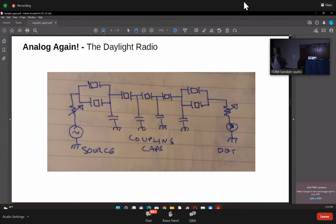The good thing about having a 2 megahertz VFO is that it's going to be dead stable. It's going to be really stable. In fact, it is so stable that I can actually decode FT8 regularly. Okay, after 15 minutes of warm up, I can do that.